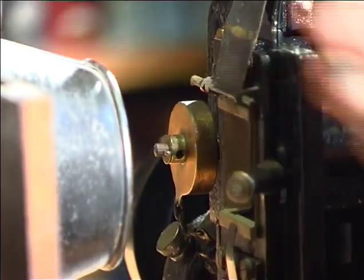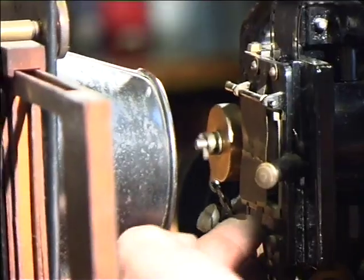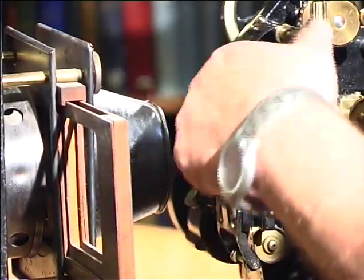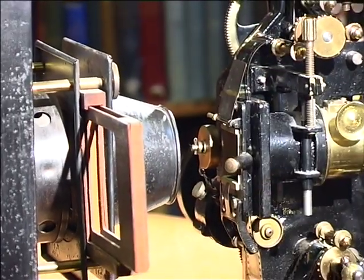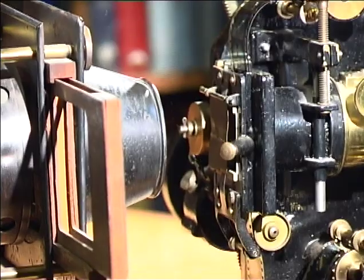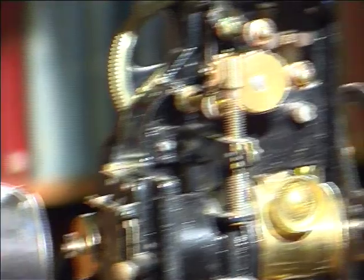That's the wrong. So when you're normally running your projector, you would get it up to speed, and then this little flap needs to be opened like that to let your light through. If at any time during the film performance it breaks and the film would jam in the gate and of course catch fire, that's a little safety shutter. Shut it down, turn the light off. And that's the little flap we've found on the desk. That's an extra one. It's a piece of spare, really.